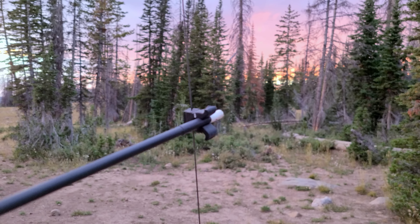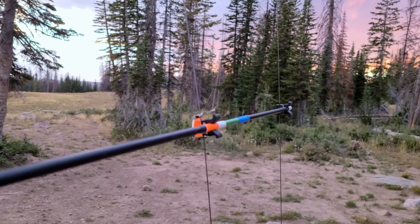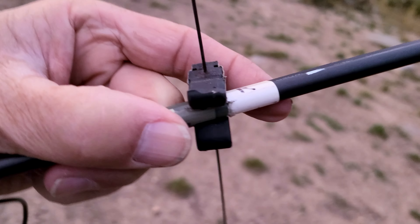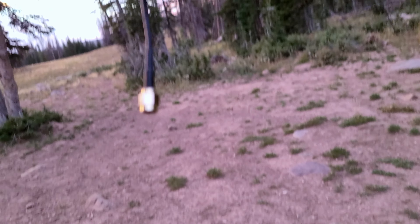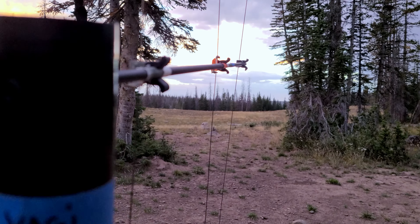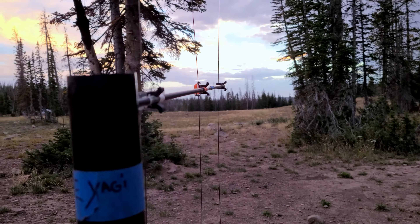It's just something I MacGyvered together, going to the outdoor store and finding something that will hold on to an arrow. So this is a carbon or fiberglass boom really made out of an arrow shaft. I use some alligator clips, some RG174, and put these clips on here for the connection. It's nothing fancy — I just made some marks on here where I could put these back, because it's not something I use all the time, but I use it in an emergency situation or something like this. On the end of the RG174, it's an SMA. My case for this thing is a one-and-a-half inch PVC tube from the hardware store. I drilled a hole on each end at the top, the size of the arrow shaft, and that holds this Yagi in position so I can either hold it, aim it to where I want, or secure it up against a tree or bush and hold its position.